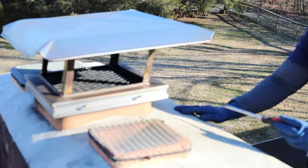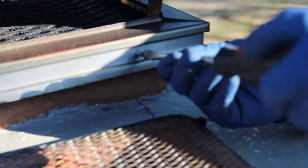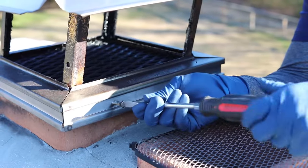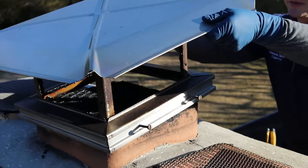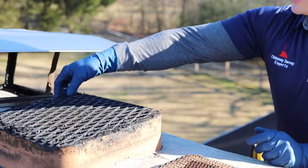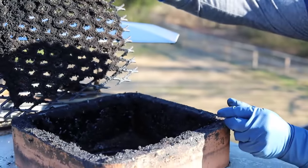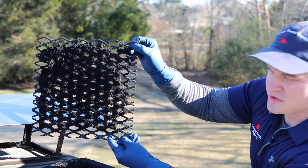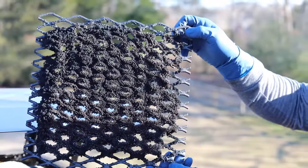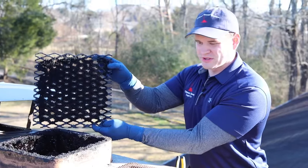Doing the inspection, we see something up here that's definitely not supposed to be, and this is a great example of why it's so important to have your chimney inspected. I'm going to pull this cap off to let you guys see what's going on here. First of all, this cap is definitely not up to code. There's just a grate that was laid on the top, and as you can see, the grate is pretty clogged up. So we can imagine this isn't going to be drawing too well. This stuff is also incredibly flammable. What we'll need to do is remove this, sweep everything out, and then get a proper cap put on with the proper clearances and proper screening.